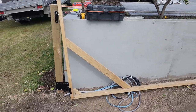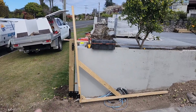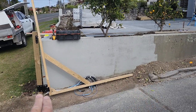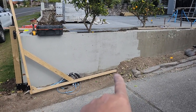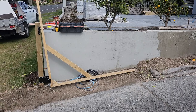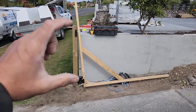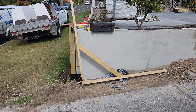You can see the 90 degree is now rising up. Because I've put my timber in, I can see that the gate is going to clear the ground at that point. The worst thing that can happen is the gate swings around and hits there. So at this point I can move this up or down to adjust the hinge gap underneath.